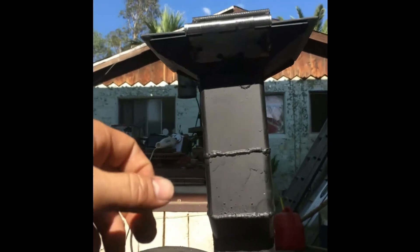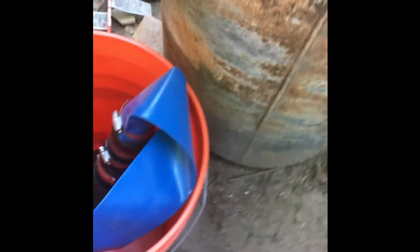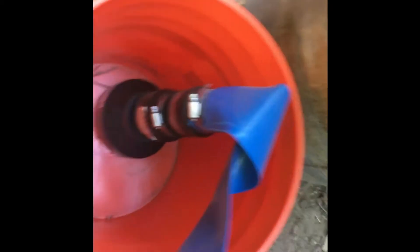The flail chains spin around at that speed, so any rock dropped into this thing is just going to get crushed. Once crushed, material comes out through all the drill holes in the side, which is the outlet tube right here. Hopefully without a positive air induction system, the material will just come right out as it gets crushed. If it doesn't, it'll settle at the bottom and I might create an air induction system — an air blower at the top blowing air down the pipe so material exits through the outlet into the collection system.